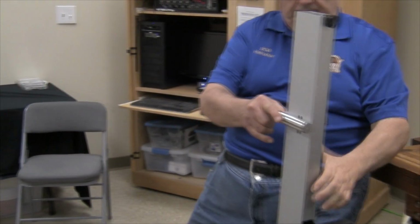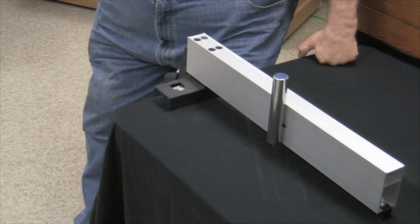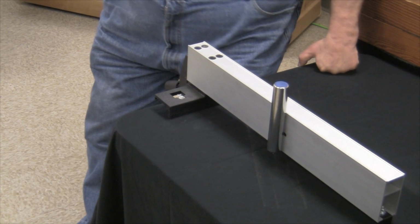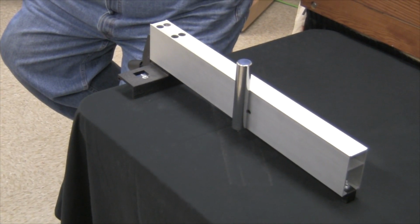When you've got that thing sitting there where you can control it, you put a line on and go across there, you're controlling it yourself. If you're using a thin piece, you're only cutting like an 1/8 inch off of that. As you're cutting that off, you're pinching it between the board and stuff, which, if you've got enough kerf on it, you're okay. But if I'm doing something thicker, I definitely will use the fence.